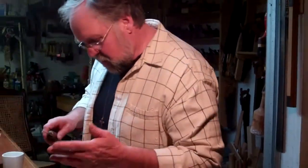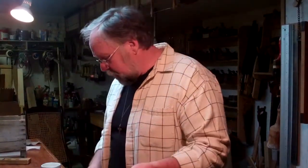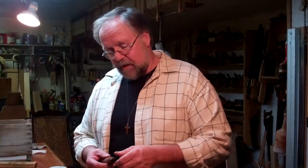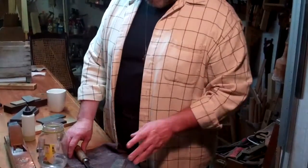Sharpening knives is low stress, very simple. There are any number of different shapes of knives, but you get the idea just from what we've done. Use stones that get to the edge — water stones, oil stones, whatever you need — and simply sharpen them and try them out. See what they work like. Find the angles that you like. Don't go to a book looking for them; find the angles that work for the way you work. Knives are wonderful tools. You can do so much with them — don't neglect them in your shop. Get them, sharpen them, use them for all sorts of work. It's good practice sharpening because it's no stress, no worry about particular angles, and it will set you up for the next class of tool that we're going to deal with: bench chisels. So we'll see you then.